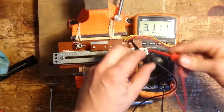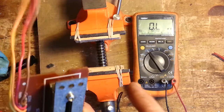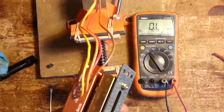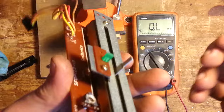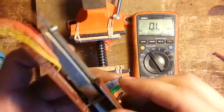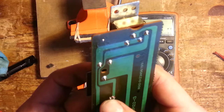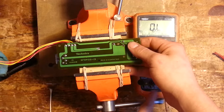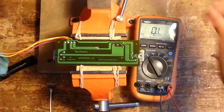I'm going to go ahead and reinstall the LED. The LED should just slide back down in there — push it down until it seats, it'll kind of click into place because it's got little tabs on the bottom of the legs that hold it in so it doesn't fall out. Then I'm going to push that one leg back down to hold it in place while I turn it upside down, and just reflow some solder here.